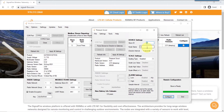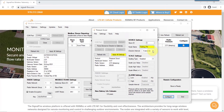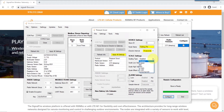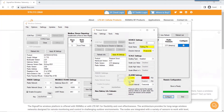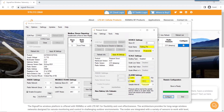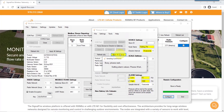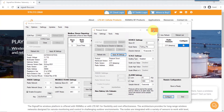You can change the node ID, node name, and how often it checks in. You can also change the scaling of the device — for example, converting pressure to level — and you can see the battery life in the bottom left-hand corner. You can also set alarm thresholds where the pressure scout will sample faster if a threshold is met — say pressure less than 10 psi or more than 1,000 psi — triggering a fast sample interval mode. This is very useful for intermittent situations where you want to capture more data points. Apply those settings and you've done configuration without being physically attached to the pressure scout.